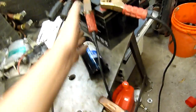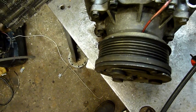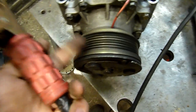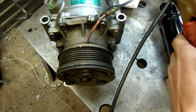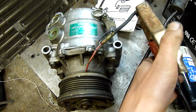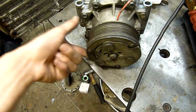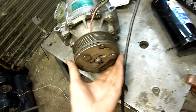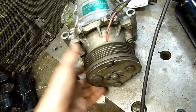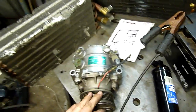When you turn your air conditioning on in the car, all it does is energize that clutch and turn your fan on. For the main part of the system, this pulley is just freewheeling as the engine's running, and then when it calls for cooling it pulls in and clamps onto it — now it's locked in with the compressor and it'll drive. If I take that off, the engine-driven pulley freewheels. Pretty straightforward — the magnetic clutch turns mechanical motion into compressed gas and circulates it through the system.